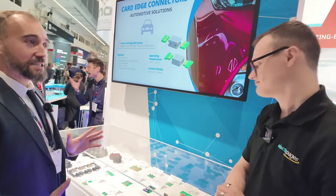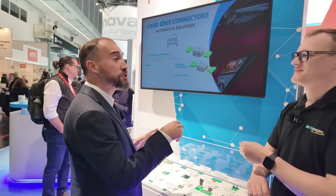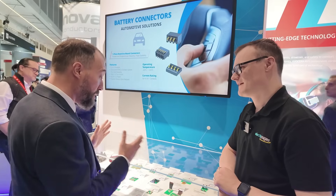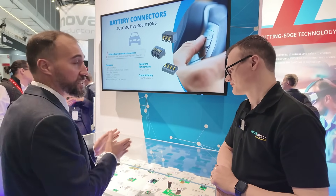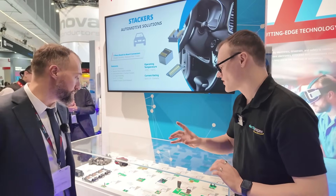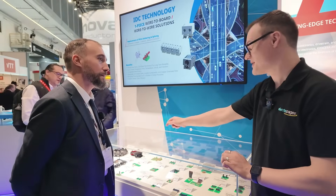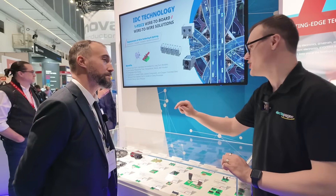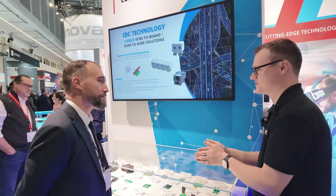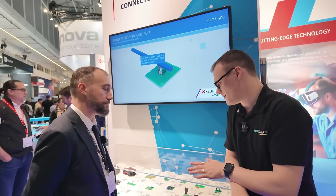On tolerances it can be a bit tricky — not a problem when soldering, but when you need accurate positioning into an IDC slot it requires care. Kyocera AVX came up with a wide range of products where the pitch can be adjusted to accommodate the majority of capacitors on the market. Personally, the dual-entry card edge is also very appealing — it would be perfect for a current design needing cards mounted vertically, as vertical M.2 keys are hard to find.